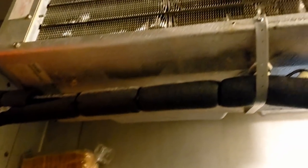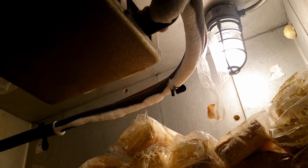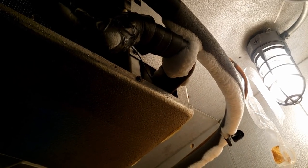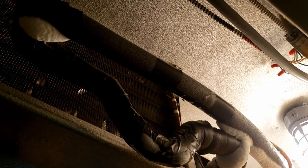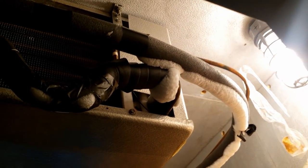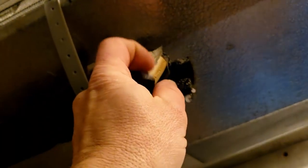Got that chopped off, it'll be fine — ain't gonna hurt nothing. Going back in there to see what else we can find. We went ahead and ran a full bowl of water through it and put it back into defrost. I filled the 45 there with some silicone. I'm wondering if it's not dripping off of these lines here — I don't have enough of the thicker insulation we normally use on a freezer, not enough on my truck. I'm gonna check with the guy that owns it and see what he has to say. The defrost is set for 35 minutes, which isn't out of line.